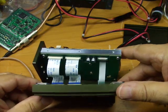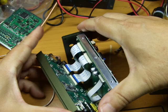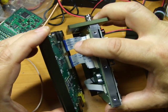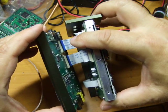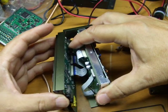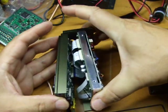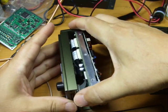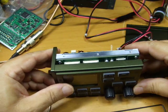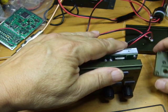Okay, now I'm going to put this back together carefully. Some of the fun and games I had was making sure that these ribbon cables would fold up nicely inside when this went back together. Notice I didn't take the side panel off here with the antenna jack, because that's bolted to the RF deck — there was no need to remove that. So I have to kind of catty-corner the board in here so that the sockets line up with the holes on the other side, making sure we're not bending any of the ribbon cables out of shape. Then before I start putting screws back together, I can place the side panel back on.